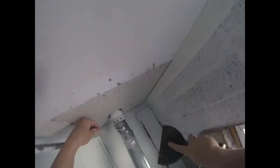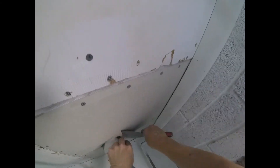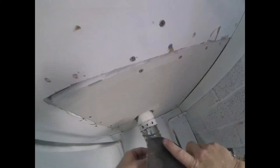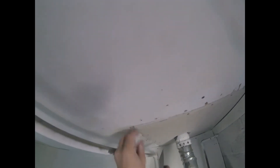Then we like to scrape the joints — scrape all the rough areas — then follow through with the fiberglass tape, fiberglass mesh it. I always scrape my areas before I apply any fiberglass tape. That screw needed to be put back in — it wasn't fully in. I always use fiberglass on my patchwork — that's what it's made for, small projects like this. Strong bond, stuff will never crack out. Work around the pipe — we tape up to any type of pipe, plumbing pipes, any type. We always tape up nice and tight and make a nice perfect finish with no gaps. Sometimes the tape is stubborn to stick because it's a little dry and dusty, so it doesn't bond as well.